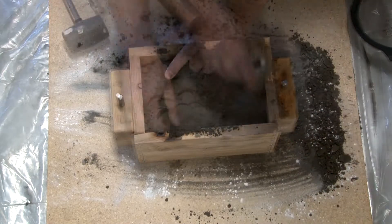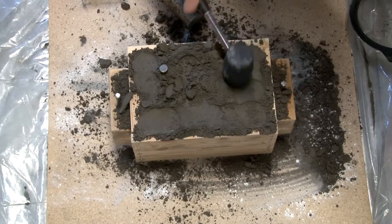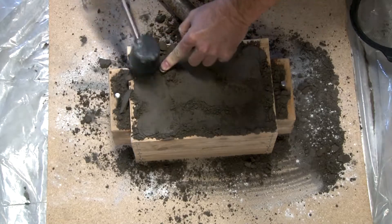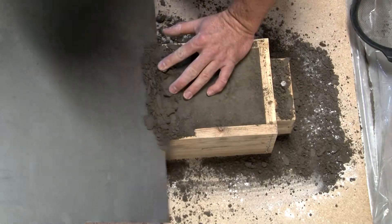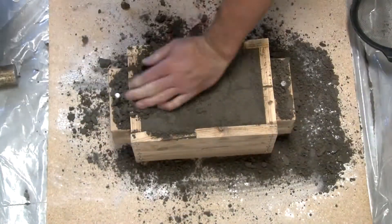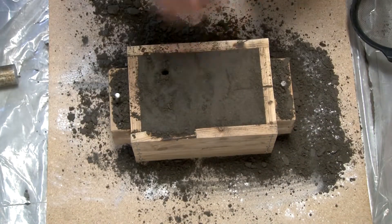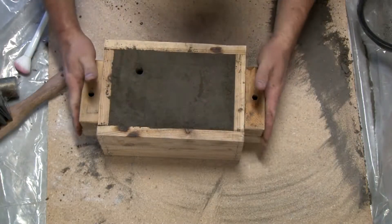When I pack the cope, I've got to put my finger on the sprue so it doesn't wiggle around. I'm just packing the top again. I'm holding the sprue with my finger so that way it doesn't get hit by the hammer and move out of place. It makes it a little bit more difficult to use the sheet metal to clear the top off but it does fine.